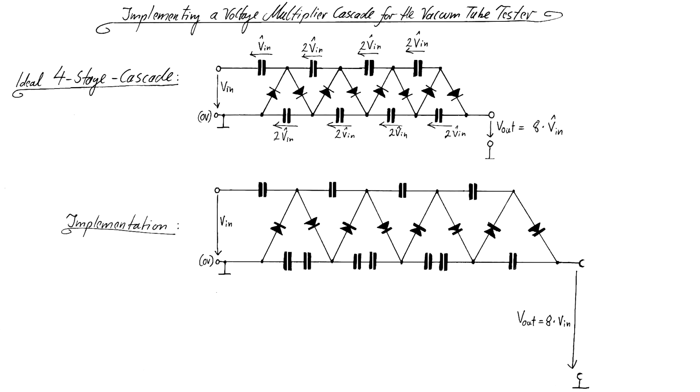The actual values of the available capacitors are the following. 1 4 microfarad 300 volts capacitor, followed by 3 5 microfarad 500 volt capacitors, which I have additionally salvaged from old dishwasher motors. In the lower row, we will have 3 pairs of 8 microfarads 300 volts capacitors, each comprising a 4 microfarads 600 volts capacitor. The last capacitor in the row is rated for 4 microfarads at 630 volts.